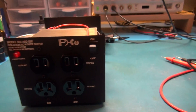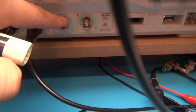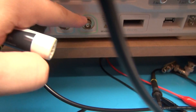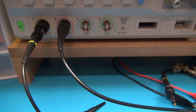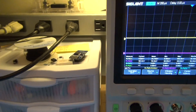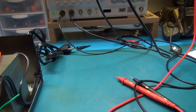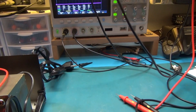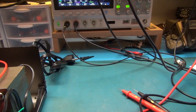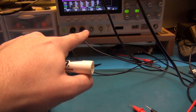What happens is your oscilloscope BNC cables and BNC connectors are all connected together. If you put a continuity check between those two terminals they would be connected, and they'd also be connected to your earth ground. So floating your scope is not a good idea because you do not want to disconnect that BNC from the earth ground.